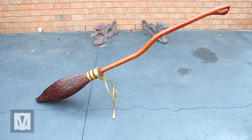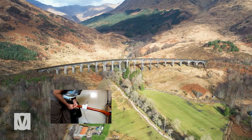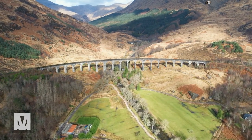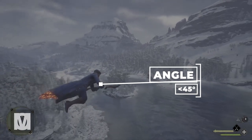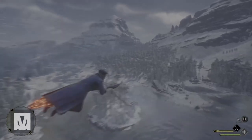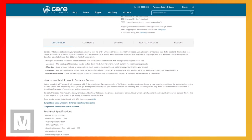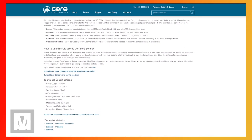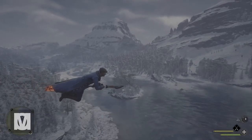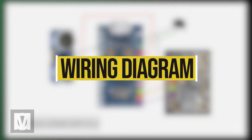With that sensor mounted on the broom it will allow me to gain accurate positioning data. Moving on to the second most important part of the project: broom propulsion. I looked over how the main character flies in-game and noticed that at normal speed their torso is at a certain angled distance from the broom, and when activating the speed boost the MC ends up practically hugging the broom. So I decided to go with the HC-SR04 ultrasonic distance measuring sensor. With this sensor I can mimic the body movements of the MC — if I hug the broom in reality, the MC hugs the broom in game, activating the speed boost, synchronizing my body movements with the character's.